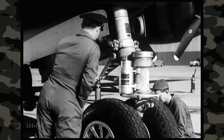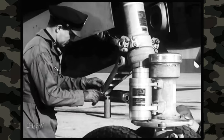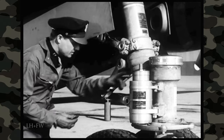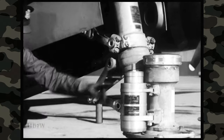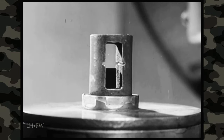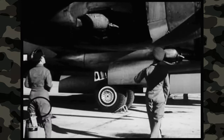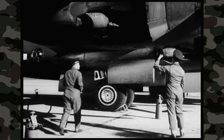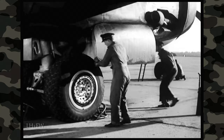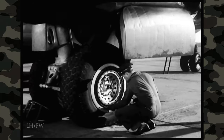After you've measured the pressure in both tires, give the gear a visual check. The strut should be clean, with a clearance between pin centers of 10 inches. And the shimmy damper must be full — that's important. Make sure the rod is almost up to the notch in the gauge on the shimmy damper reservoir. Now you can look over the engine cowlings on your way to the other main landing wheel. This gets the same inspection you've already given its mate. The co-pilot ducks into the wheel well to inspect the equipment there, while you work on the wheels.